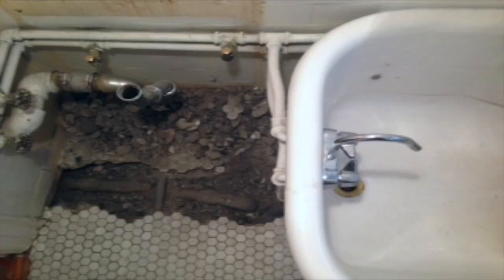Can you really blame the 'clean any drain for $49.95' guy for poking a hole in this lead trap? I think not, folks. I've done this myself. It's a 100-year-old plus building, and when you put a mechanical snake in an old drain like that, this is the chance you take. That's just what happens. If the water doesn't go down, you pretty much have no choice.